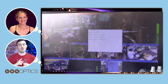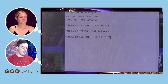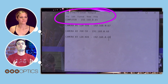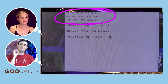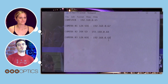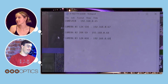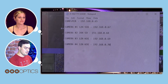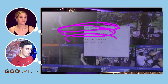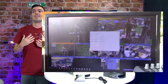Finally, let's talk about networking. Your computer has an IP address. You can run everything over serial cabling — the PTZOptics Producer Kit does not require any networking knowledge. You plug that computer into your network and can stream to Facebook or YouTube. But if you want to take it to the next level with an iOS or Android camera control app, or have vMix control your cameras, you need to know Power over Ethernet. You can plug the cameras into a PoE switch without having to plug them into power separately. Each camera has a unique IP address, which is how you can control each one with that automated playlist.